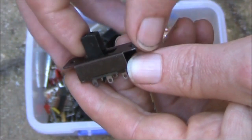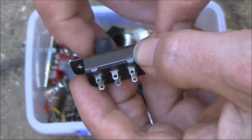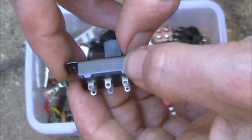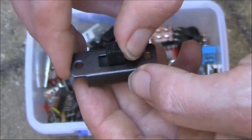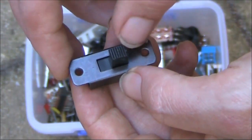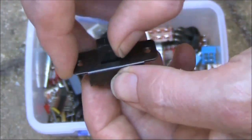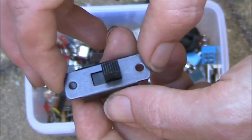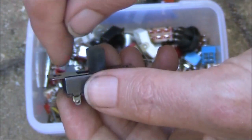These types of switches are probably amongst the cheapest — the slide type switches, double pole, double throw. It's a little bit bigger than normal. I still wouldn't use something like this for mains or high current DC, but for most general purpose, low voltage, low current switching, it would be fine. The main awkward thing is that when mounting them behind a panel, you don't just drill a round hole — you have to cut out a square hole, drilling several holes and using small files to make a rectangular opening. There are two holes here for screws, and some of these switches are threaded so you don't need a nut on the back.